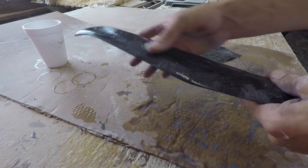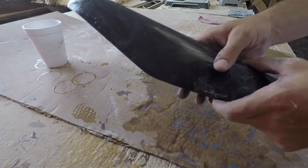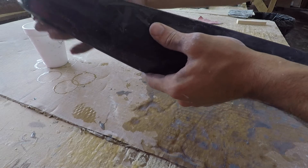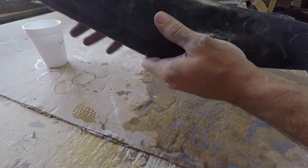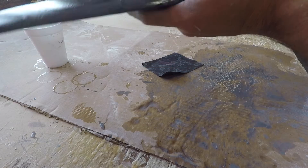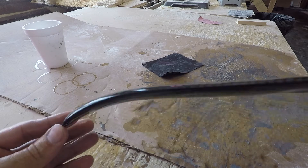I just went in and took out those last few remaining low spots. Now I want to feel the edges — you don't want them too sharp but you don't want them completely round either. Right now with the 220, since it will still remove some material, is where we want to get the edges where we want them. The best way is just by feeling. All the edges are feeling pretty good; I already went around just a few times. So all the edges are good — I'm going to give this part a rinse and move on to 320.